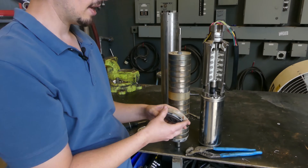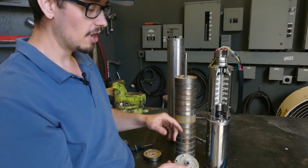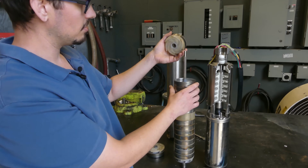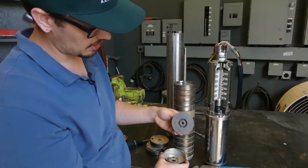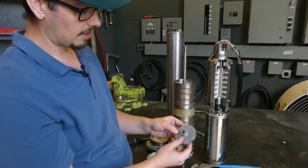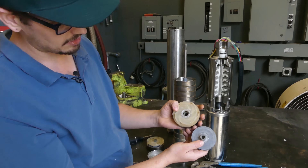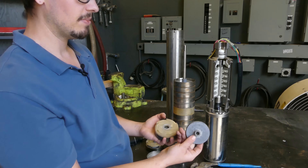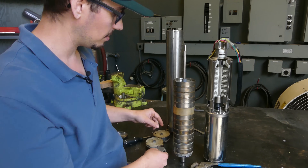This is the portion that actually spins — the impeller slinging water up through the next stage, going from top to bottom. Interestingly, when it comes to multi-stage pumps, each stage increases the pressure but has no impact on the flow — kind of a cool brain teaser. Here's what a good one looks like. That impeller right there is in pretty good shape, definitely service-worthy. It does have some wear in certain sections, but that impeller would probably still work just fine for at least a period of time, as long as there wasn't too much up-thrust.